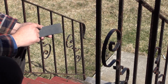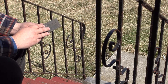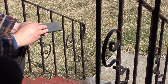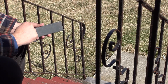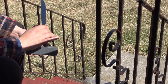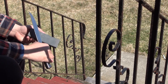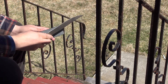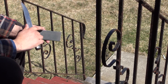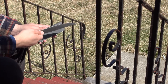The reason it's abusive to the stone is that the pressure is so high it literally breaks the stone apart. This is a very hard stone that doesn't release abrasive on the flat, but when grinding on the edge the pressure is so high — equivalent to hundreds of pounds of force against the flat — that the stone will just fragment and wear extremely fast. It also mangles the edge in terms of stress, putting tremendously high pressure on it as well.